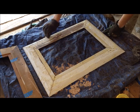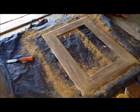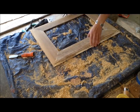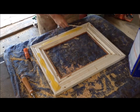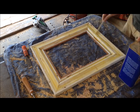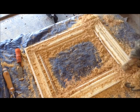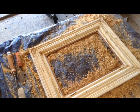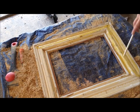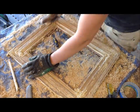For the two picture frames that were painted I'm stripping the paint off. If you want them painted, your life will be much easier — just sand the old paint until smooth, get all the loose stuff off, rough up the finish especially if it's a gloss finish, and you can paint any color you want. If you want to strip the paint, I use chemical stripper. Sometimes it takes everything off in one go. For the frame with all the detail molding I did a couple of rounds, and once it's set I use a wire brush to get a lot of that paint off. Be careful with the wire brush on pine as it will scratch the wood underneath. The mahogany paint came off quickly; the detailed one took a couple of coats.